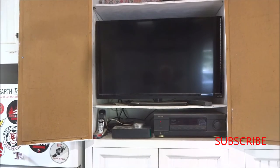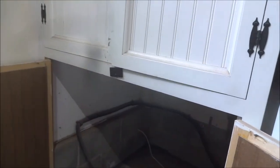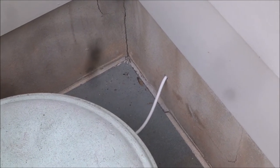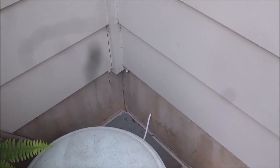Right there is the TV that's inside the garage and the cable box is right there. Over here on the other side of the refrigerator are some cabinets, and this little cubbyhole down here is where I store my standby generator. Right there you can see where the coax comes from behind the refrigerator and the TV and goes outside. Right there is where it comes through the wall onto the patio and snakes its way over to the TV. We're going to enlarge that hole using a one-inch masonry bit with my Milwaukee rotary hammer.